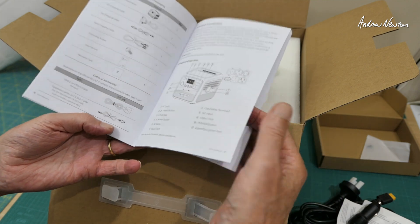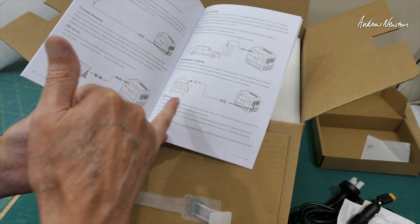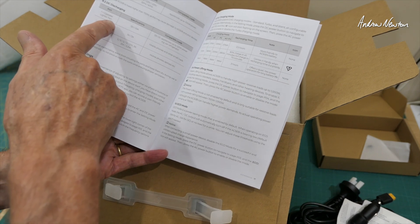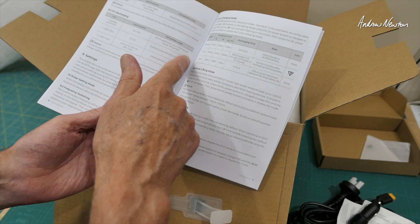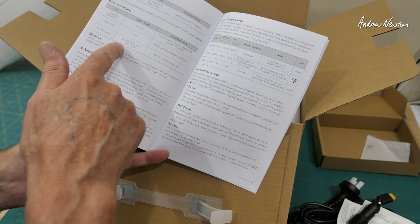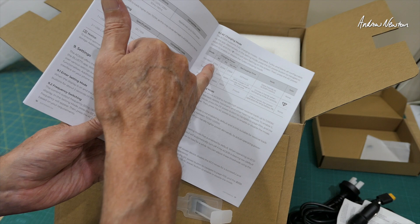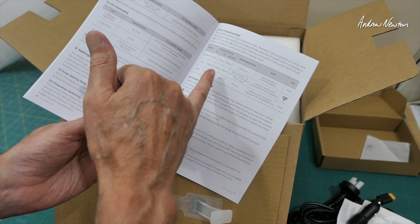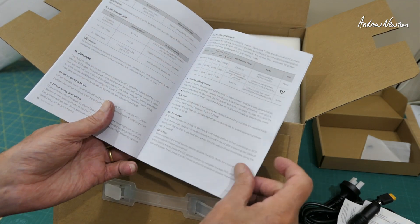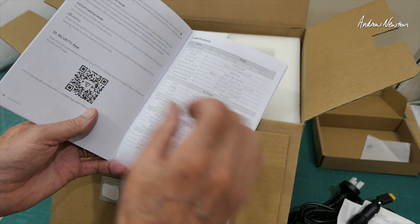The manual shows all the different charging scenarios: AC power from the wall, solar panels, in the car, and from a petrol generator. AC outlet appliances up to 700 watts, cigarette lighter port for 12V DC appliances up to 120 watts like a car fridge. USB-A at 5V 3A for phones and small loads, USB-C for phones and laptops. Recharging time is two and a half hours standard at 275 watts; with turbo charge you can reach 80% in 45 minutes and full charge in 70 minutes. Battery capacity is 448 watt-hours or 20 amp-hours, lithium iron phosphate cells, net weight about 7.5 kilograms.